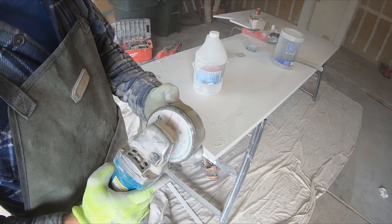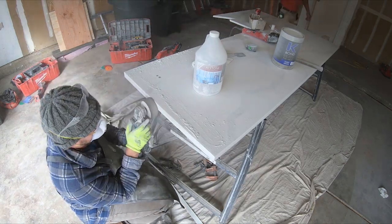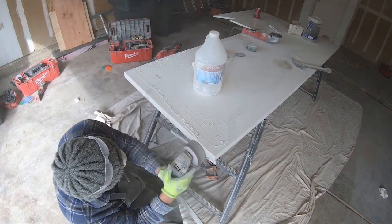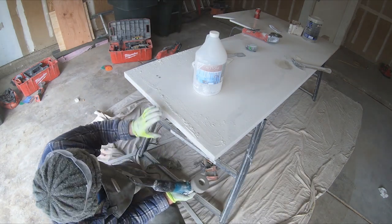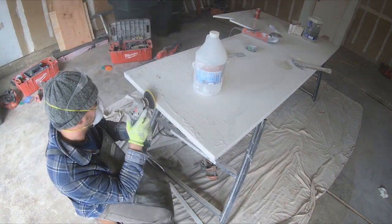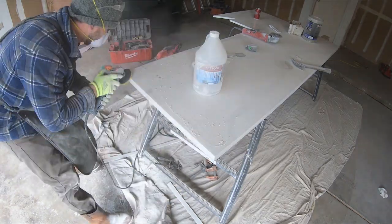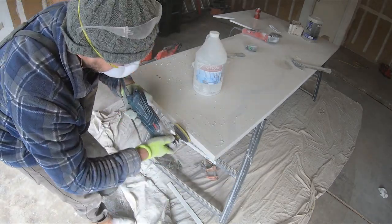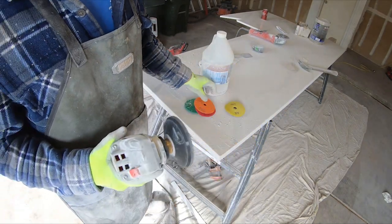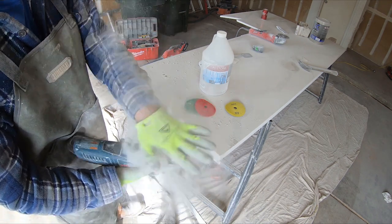This is a stone — I start with a 40 grit and just get rid of any deep scratches. When you are polishing, you've got to look at it. You can't just go over it and assume it's going to be perfect. What I see happening a lot of times when my guys do it is they rush it and leave some deep scratches when they're on the lower grit numbers. Then once they get to the higher grits, it's too late — scratches are still really deep and you have to start all over.